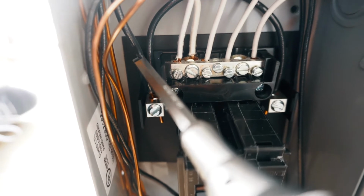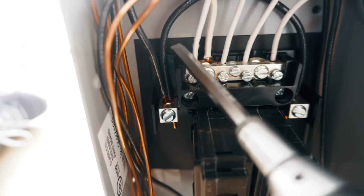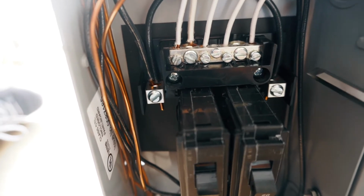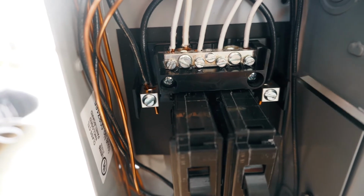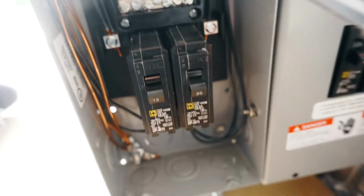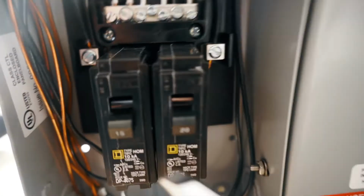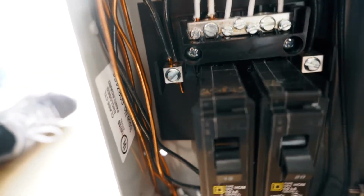So this is the line that comes from the inverter, so it's the power in. And this is just a short segment of wire used to connect these posts to these posts. It's called a jumper wire. I just use this to connect 2 of them so that they are on the same potential, and I can use both of the breakers in the same equivalent way. And all these black line wires come out from the bottom of the breaker. Each breaker can connect 2 of these wires. These wires go out to the yellow 10 gauge wires, the main wires of our house.